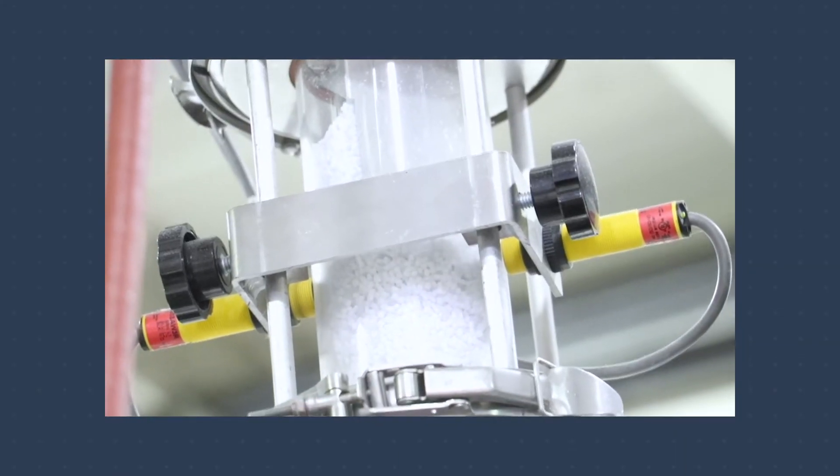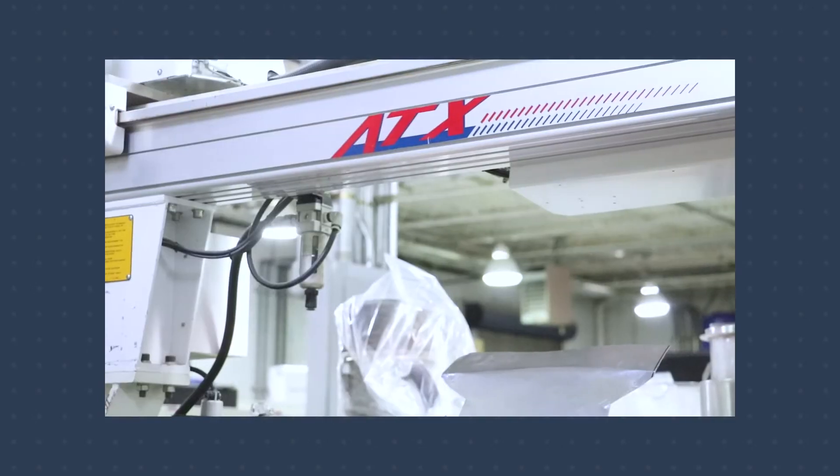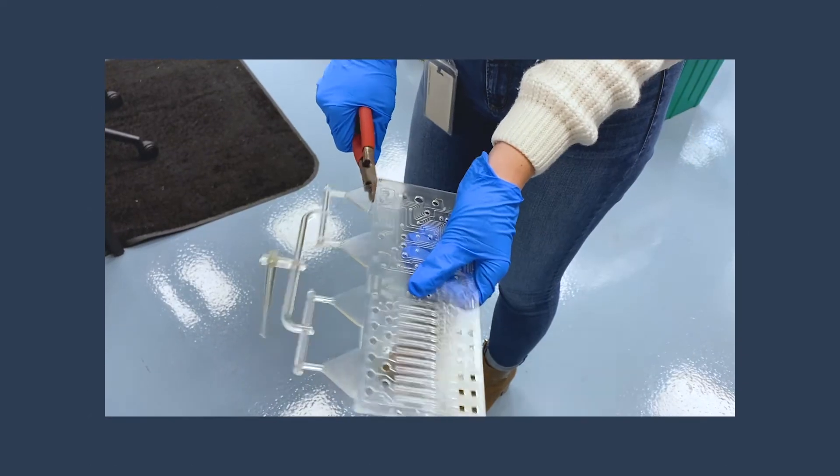In injection molding, the plastic enters the metal mold and passes through the gate to fill a part. Everything leading up to the gate is called the runner, and after that is the plastic part. When the part is ejected from the mold, the runner needs to be removed from the part. This can happen automatically, where the runner breaks off the part in the mold, or manually, where an operator trims off the runner or gate. What's left behind is called the gate vestige — that's the mysterious bump on your plastic injection molded parts.